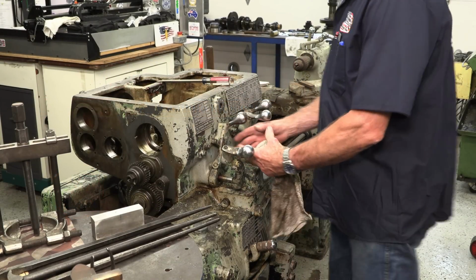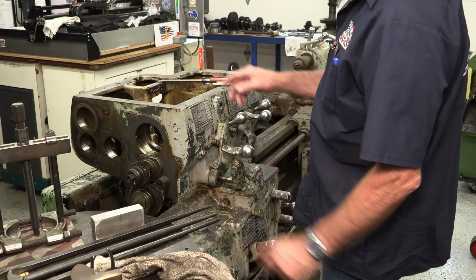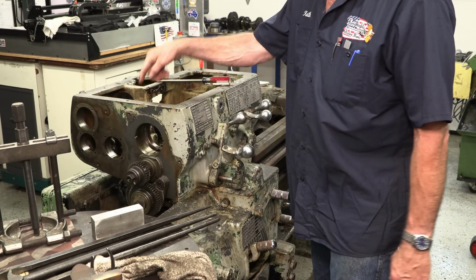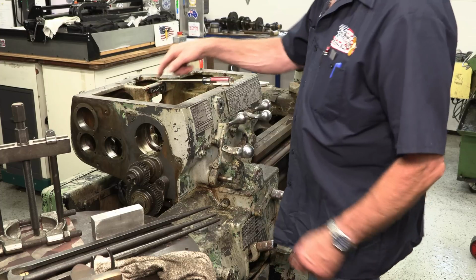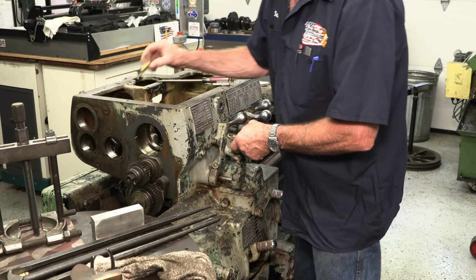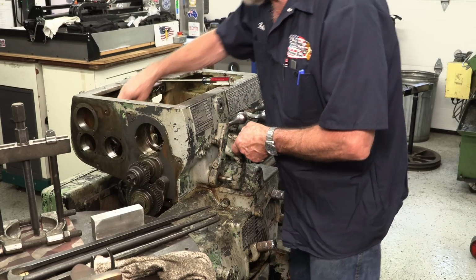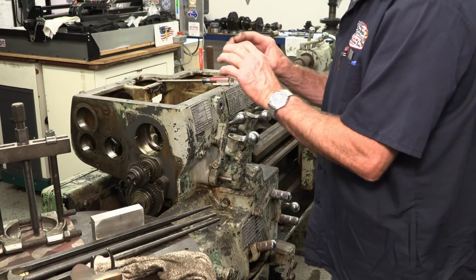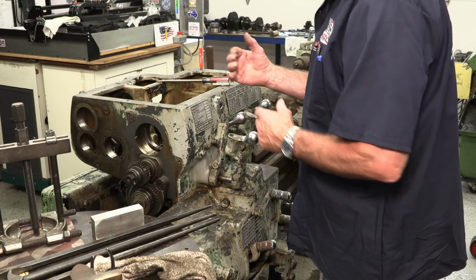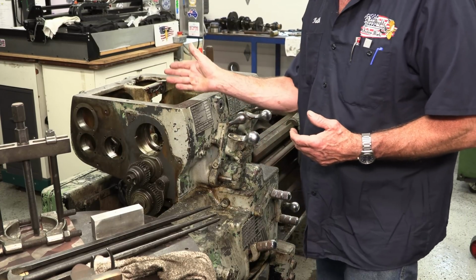We're going to go ahead and pull our shifting yokes and handles out. Now we've already taken the square set screw out of the yoke over there, and there's a spacer in the yoke, and I've got a piece of key stock right between the yoke and a little collar that locks the thrust on this.